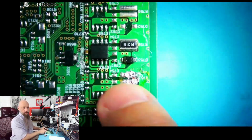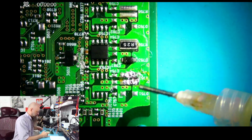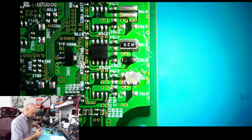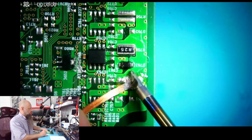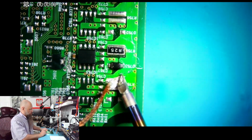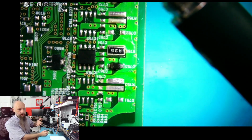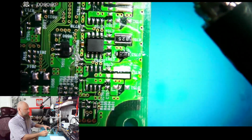So now I want to clean this, right? So what I would normally do, I'm even gonna use the good expensive flux, right? Good expensive soldering wick. I'm gonna sacrifice my fingers for this presentation. Okay, so it looks like it did. Once I mixed a lead-free solder with leaded solder and then wicked it, it looks acceptable. I mean, not perfect.